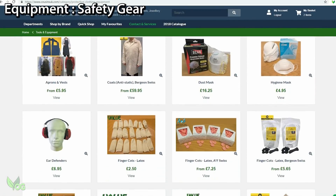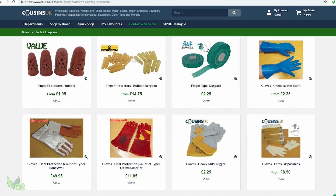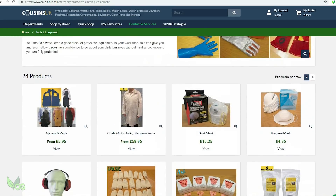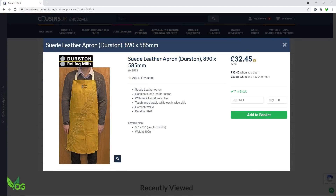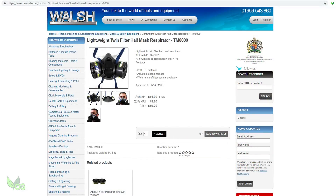Lastly, don't forget the safety equipment. I've never really covered this in any detail as it's largely a personal choice and common sense, but here are my minimum recommendations: a full face cover — not just goggles, as molten metal can splash — a thick leather apron and sturdy boots for the same reason, quality gloves to stop you burning yourself, and finally a mask, especially if you don't work in a well-ventilated area, which you really should.